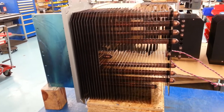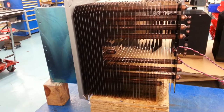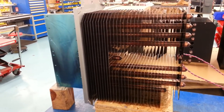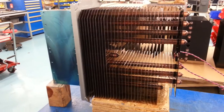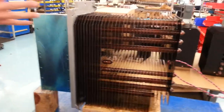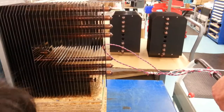And of course that's the speed of the train providing airflow. When they're in the station, all the components are in an idle mode — low current. Of course when they increase the load, they change the frequency, the PWM changes, the inverters produce more load, more heat, more watt loss. Watt loss is transferred through here into the heat sink, into the fins, and naturally convected through the movement of the train.